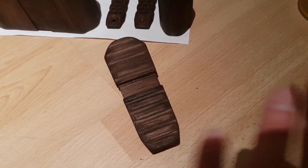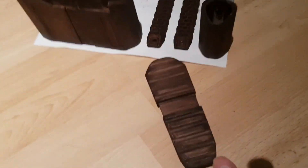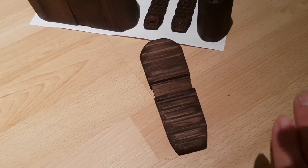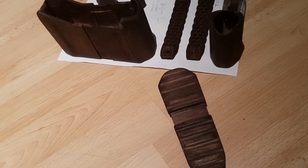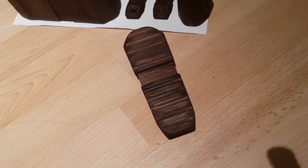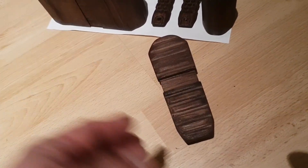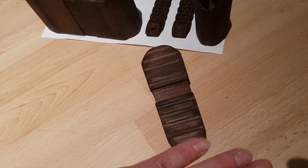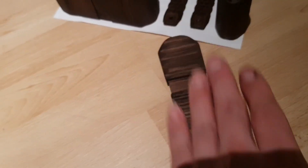The trick is I sanded it. Sanding is the most important part. If you want to apply anything on 3D-printed parts, I use very rough sandpaper, just in one direction. So I created a really natural-looking wood grain. Because it's wood, right — it cannot be perfect, it has to be natural, it has to be rounded. I rounded and sanded, and when I designed it I already rounded it in the AutoCAD model, but while I was doing the sanding I made all the edges even more rounded.